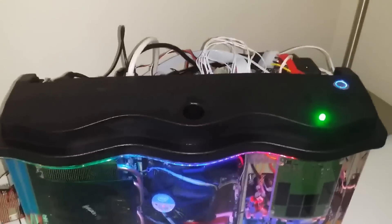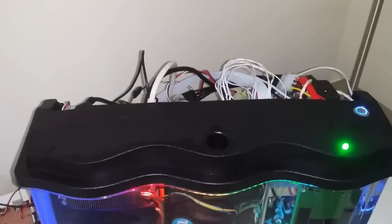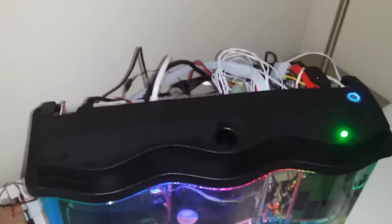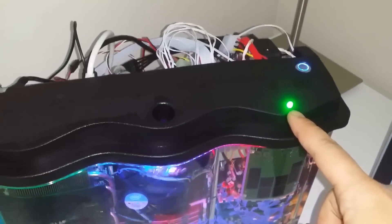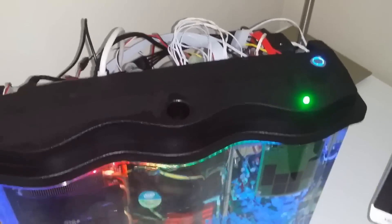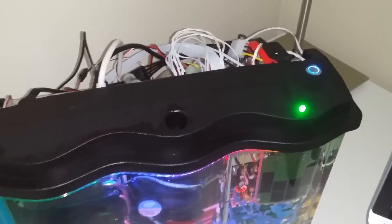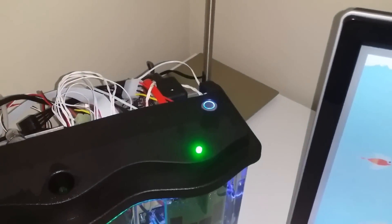All the wiring — I cut up this lid to expose the back. The wiring is a little messy, but there's an HDMI cable, all the USB ports, and I added two more USB 3.0 ports. There's also an RGB LED: it's green when power's on, it will blink red when there's hard drive activity, and it will be blue when the computer's in sleep mode. And there's a power switch that's always glowing blue.